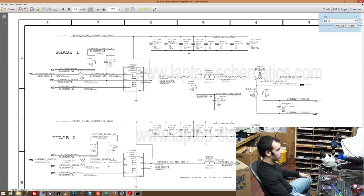So pretty much this signal over here controls the resistance of this variable resistor. And this over here controls the resistance of this variable resistor. Now, when this is going like it's supposed to, it's sending 12 volts through phase. Obviously, it's sending a bunch of 12 volt spikes through phase that averages out into about 1 volt. And after this inductor and the capacitors, it all gets smoothed out into about a volt.